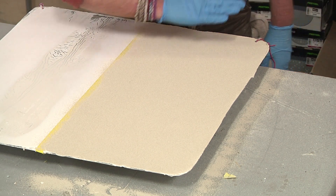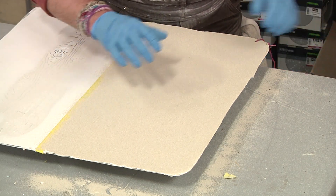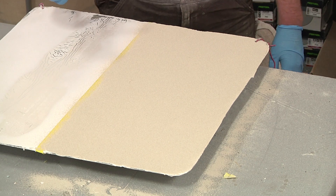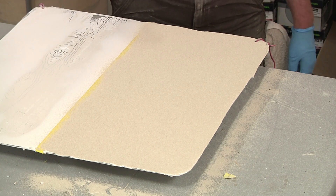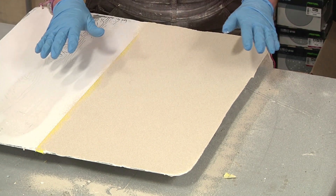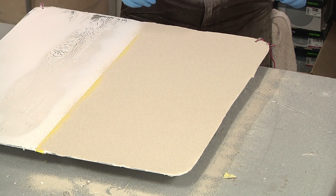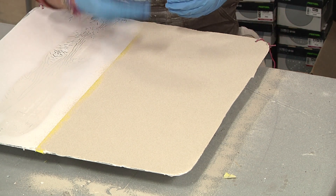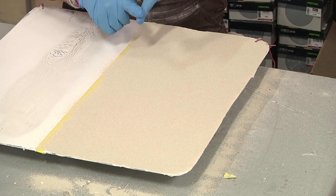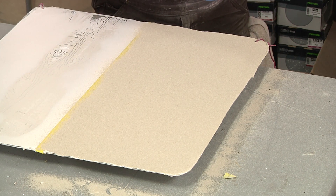As you can see, it is completely uniform in color from the soft sand. There isn't any white gel coat peeking through — I've basically completely blanketed this, which I think is what I want to do, at least that's the way I do it with the paint. Because this is a laminating gel coat, I'm going to be able to walk away for the rest of the day, then come back after the gel coat has set up, sweep up the excess, vacuum off anything that's still loose, and then come back over and top coat this with more gel coat. I haven't decided if I'm going to go over with another coat of non-waxed or go straight to the waxed finishing gel coat.